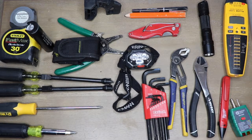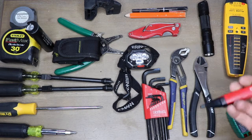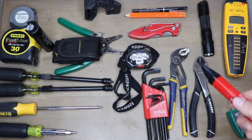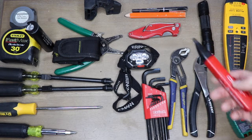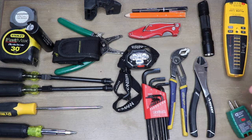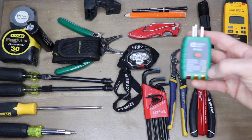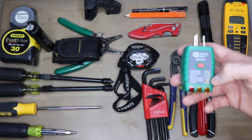Moving on to electrical — you can always find yourself a little electrical tester, a stinger. I always prefer a meter, but these are a simple way to trace out a power cord or get a visual. People will often disbelieve you if you stick a meter into a socket and it shows 120 volts; but if you have an audible alert you can say, 'Hey, your outlet is working — this confirmed it.' It sends an auditory message and a visual light-up that people tend to like. Get yourself a little outlet checker — this one can test GFIs and will give you the polarity too. Lightweight and simple: stick it in, and it tells you whether a plug has correct polarity, open hot, open neutral, whatever the case might be.